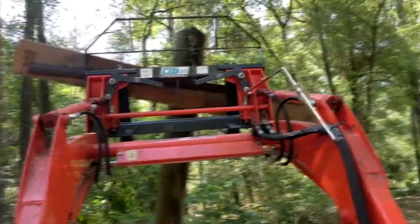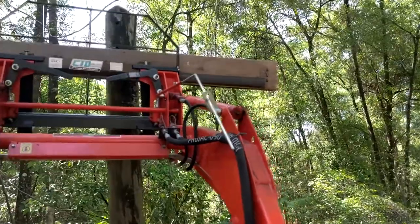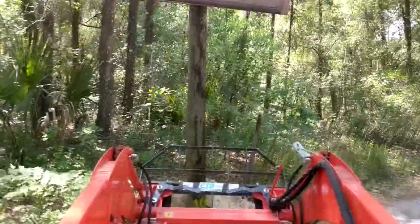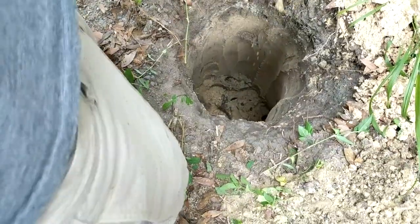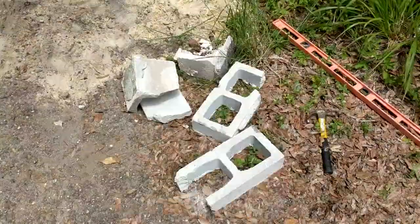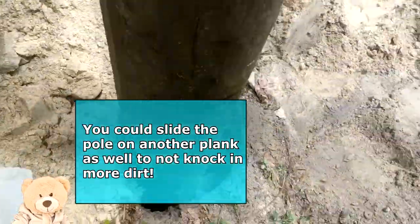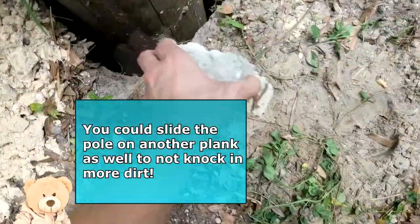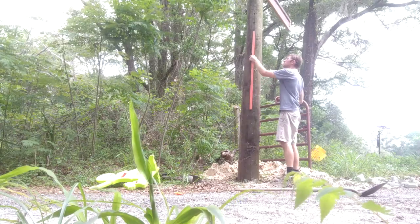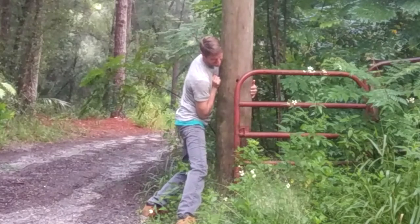Fortunately it did, but this is where I realized my mistake. After measuring the height of the pole, I realized that I had pushed in about a cubic foot of dirt into the hole while trying to drop the pole in. It only dropped in about three feet instead of the four feet I wanted. So if you want your hole to be about four feet deep, dig a five foot hole. I tested the integrity of the pole and after realizing it was sturdy enough — that is until the next hurricane comes — I continued forward. Using a level, I leveled it up and added a lot of crushed rock and cement to the sides to stiffen it up. It ain't going nowhere.